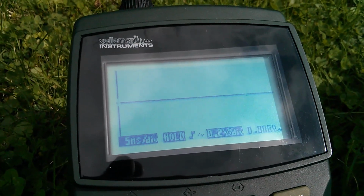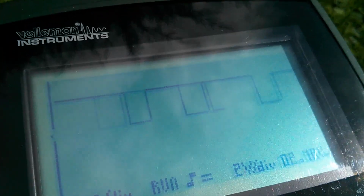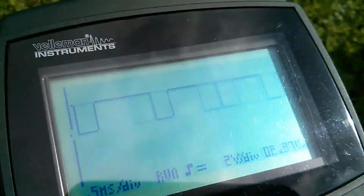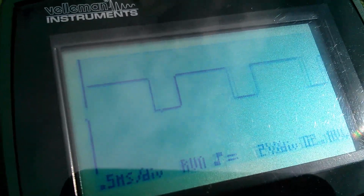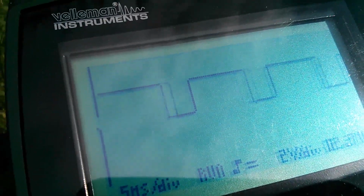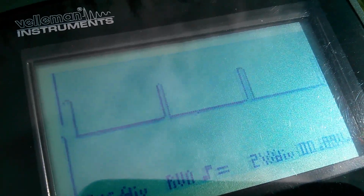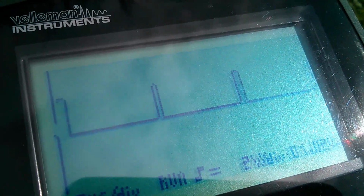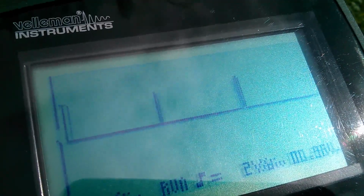Let's try again. Right, now we do have enough sun. So with the 40 watt load on, there's a lot of jitter on that. Let me just bring it down into range of the trigger. But what have we got? About 75% PWM. Now let's switch off the load, and it rapidly drops to no PWM to compensate for the fact that the battery voltage rises up, and then settles at 5 or 10% PWM to maintain the battery voltage